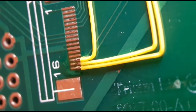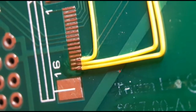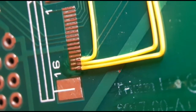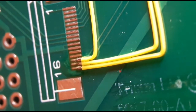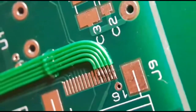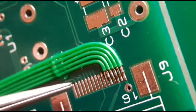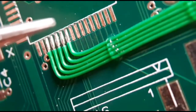You've got three nice joints with no shorts at both ends. I'll clean them all up and put a video up at the end showing all the work, with a few more pictures after this. It just takes a bit of practice — you can make some really nice mods. I've done mods with two wires or two hundred. Always try and work your route out before you start — I normally have about five routes in my head. Try not to cross wires over, go around them.